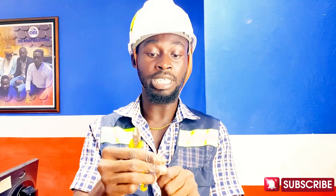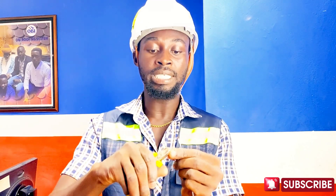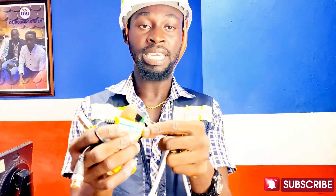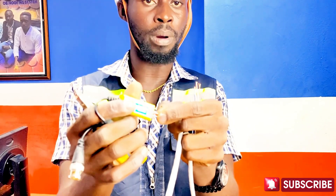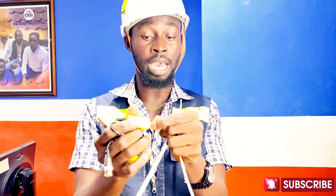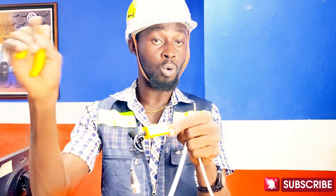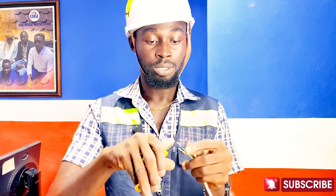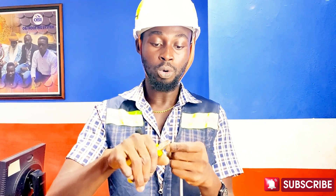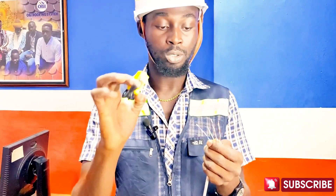These exposed sections are too long, so I cut them down. The reason I don't want them too long is that the whole cable should enter fully into the video balun — I don't want any copper wire exposed outside. If copper is exposed and something happens, it can break and affect the footage. The most appropriate approach is to have the whole cable enter inside the video balun.